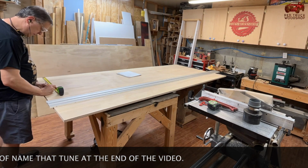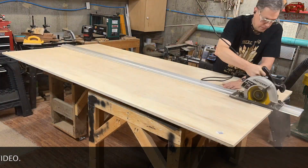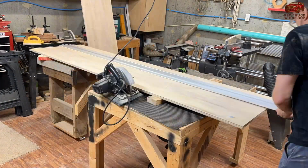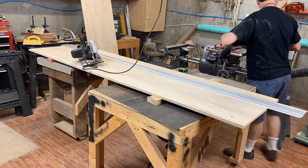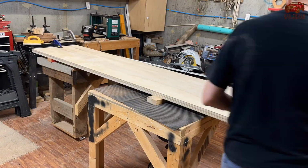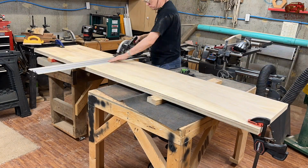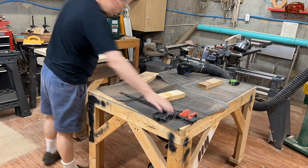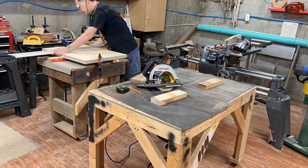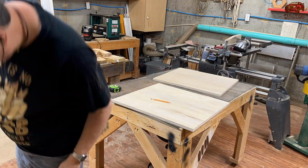After hauling the plywood into my shop, I hefted it up onto my tables and proceeded to cut the pieces to the appropriate sizes. You'll notice that I start laying the pieces on top of each other, checking that they're square to make sure everything is going to be the same size on the left side, right side, top and bottom. I've found that this is the best way to ensure that everything is the correct size, even if I accidentally cut it a little bit short or leave it a little bit long.